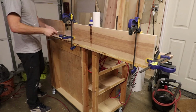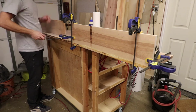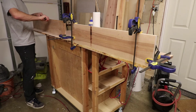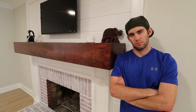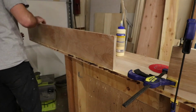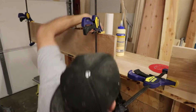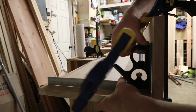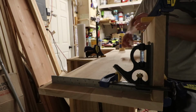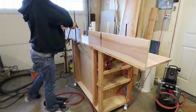The worst part about fixing this problem was trying to get all the nails cleaned out. Most of the time, I just had to break the nails as close to the board as possible and hammer them down. When I was absolutely sure that I was correct, I put the other board in place, glued it, clamped it, and popped in some nails. Then I transferred the squares over to this new board. I let that whole thing sit overnight.